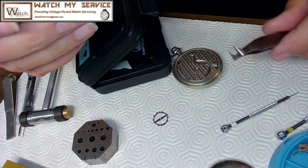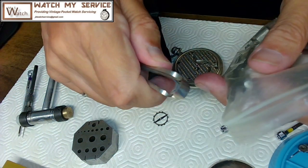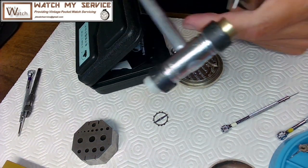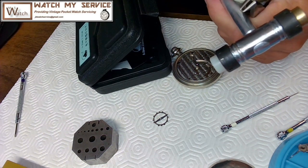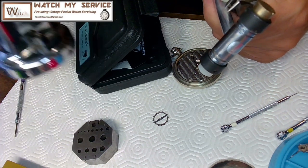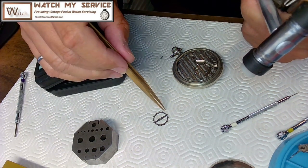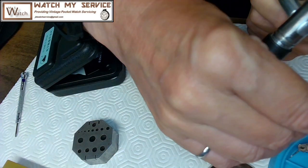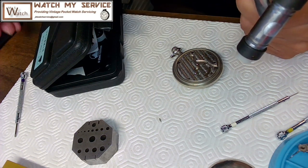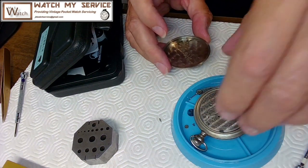Like a good watchmaker, I need to put my tools away so they don't get damaged. This particular staking tool — essentially the one for safely removing a balance staff — goes away. The pincers were of no use for this job. The hammer was useful, and now I need to put away my stake for the staking set, take the balance out of the way, and get the balance staff centered on the mat.